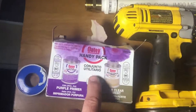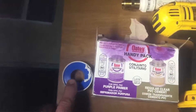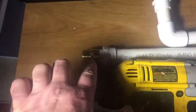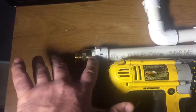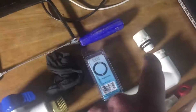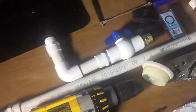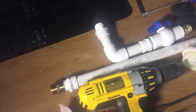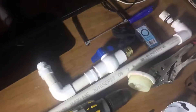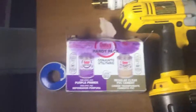You may want to use primer and PVC glue as well as a roll of Teflon tape. With the Teflon tape you seal up all the threads, and with the glue you do all the pipe fittings. It's not strictly necessary on all connections since I was only getting a little drip when I hooked it up dry, but it's always nice to seal it up properly.